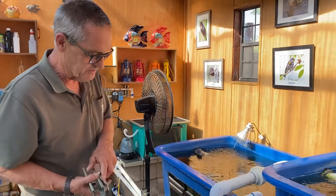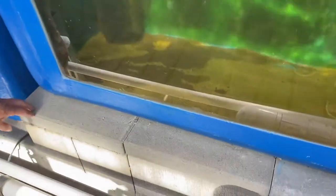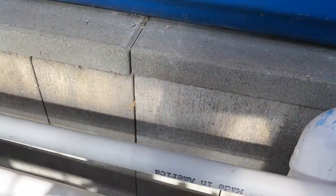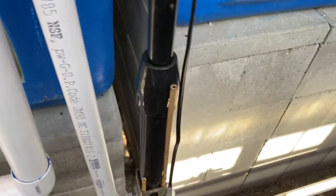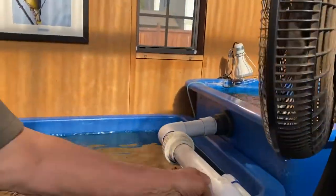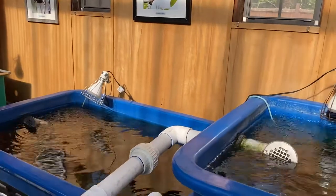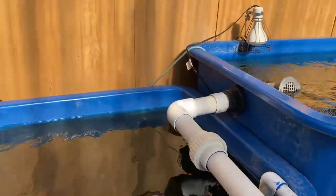Then you're just basically going to set blocks in the places. These are just standard blocks. The top block is a 16-inch paver. Obviously you have to be level. The reason these are set at different levels is because it takes 12 inches here to make this turn. So if you set them end-on like that and come out the top, the whole thing would be a foot and a half longer — that's why we did that. Anyhow, that's how we set these tanks.